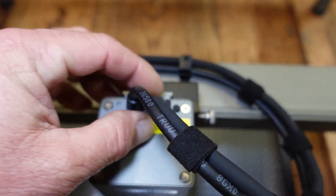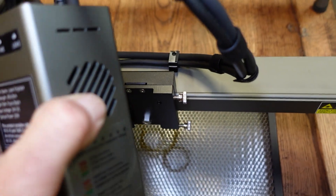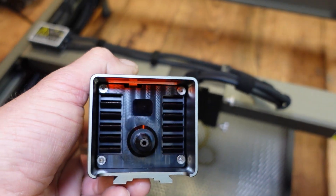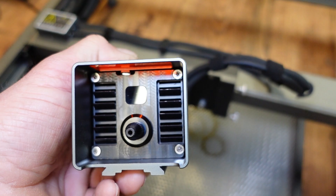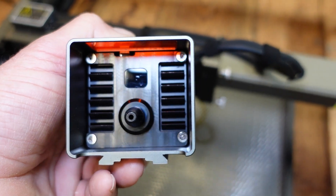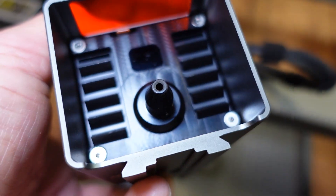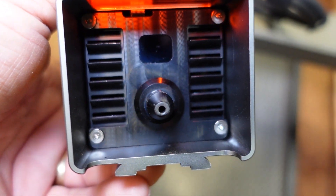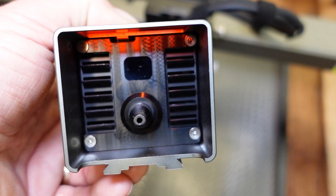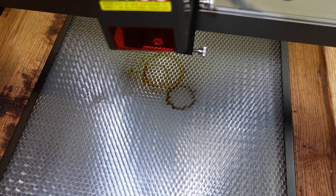There's no air assist elbow on the side — the air assist comes straight in through the top and comes straight out through the bottom. Inside you can see the nozzle, and up above it there's what looks almost like one of those ATM camera windows, so I'm guessing there's some type of optical sensor under there. The air assist nozzle protrudes out right there, so the air is coming directly in line with the laser beam, which I think is going to work really well.